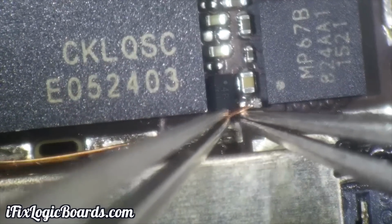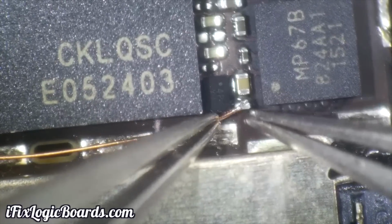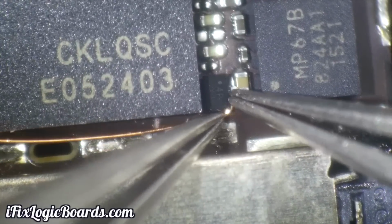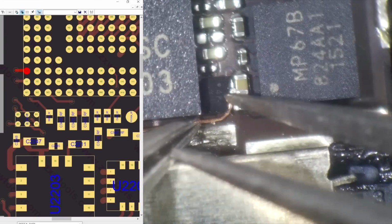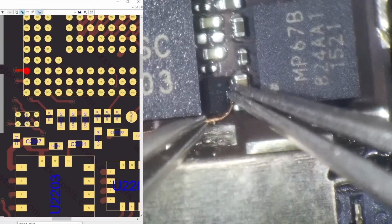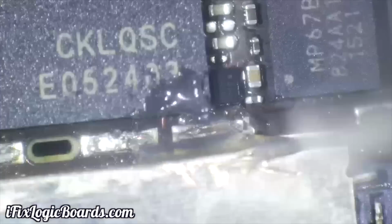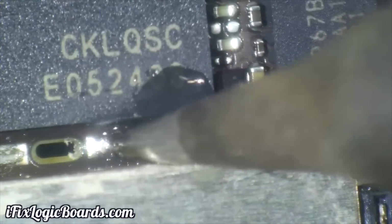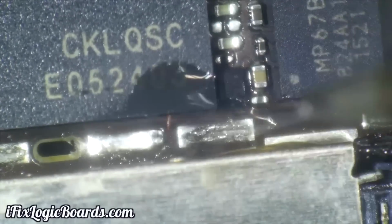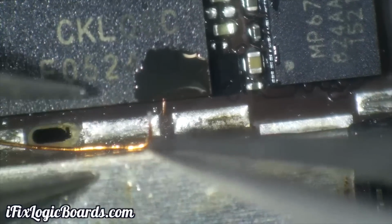And then what I do with the jumper wire, I just bend it 90 degrees and have that tip be kind of in the middle of that small chip, because that's where the solder ball under the baseband is, so it matches perfectly. Once you have that done, you want to clean up that ground plane for the shield so it's not rough, and align the jumper wire with that scratch.